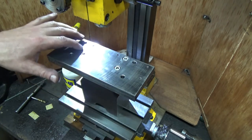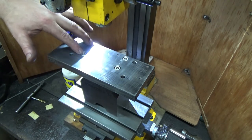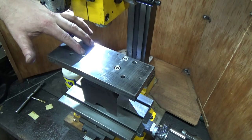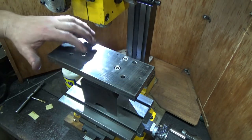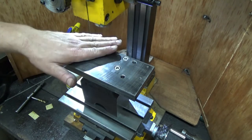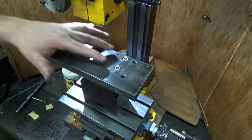They'll stretch a little bit, so I'll bring them up to 48 newton meters plus 90 degrees. I'll torque these two with some grade 9 bolts, which will stretch a little bit when you torque onto them. So I'll do those as stretch bolts.